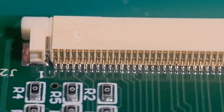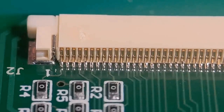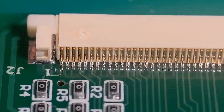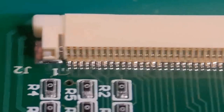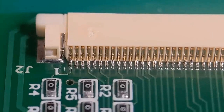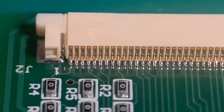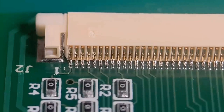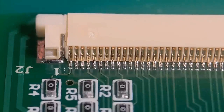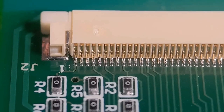The main thing with these connectors is get yourself some decent solder - 0.25mm is really going to aid your soldering on these type of connectors. I'll put a few photos up showing the end results. Thanks to everyone for tuning in and I'll be back in the near future with another soldering video. If you enjoyed this one it would be great if you could like and subscribe. Until then, take care and enjoy your soldering.